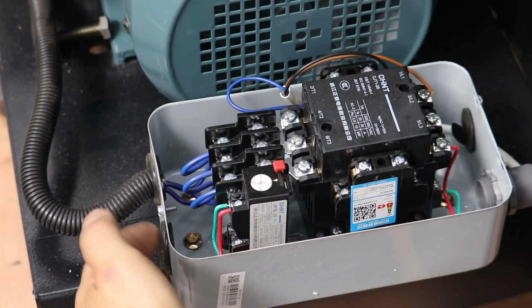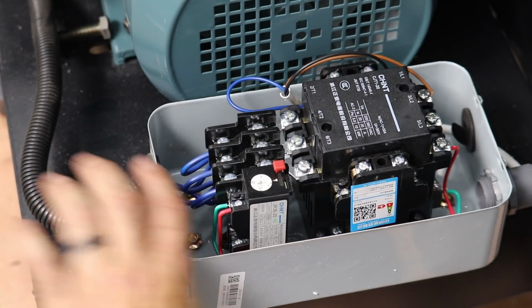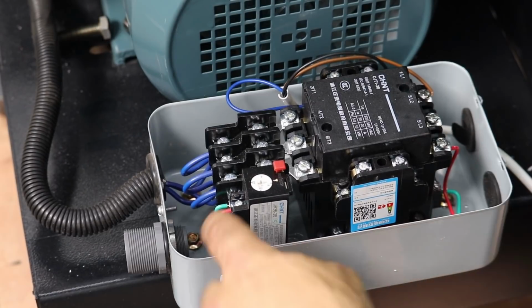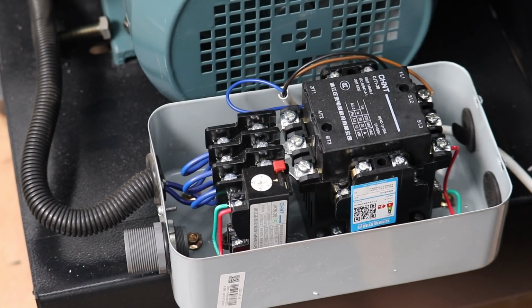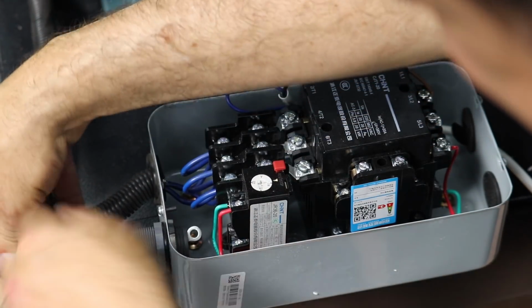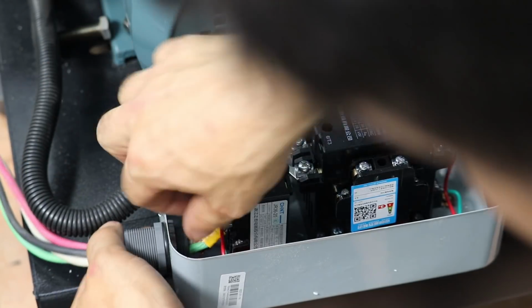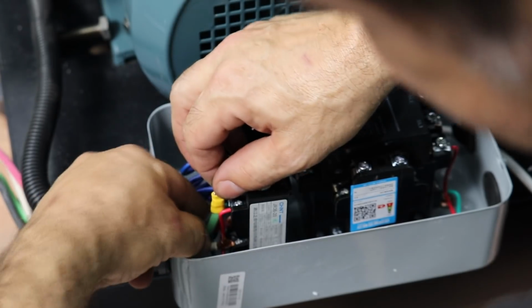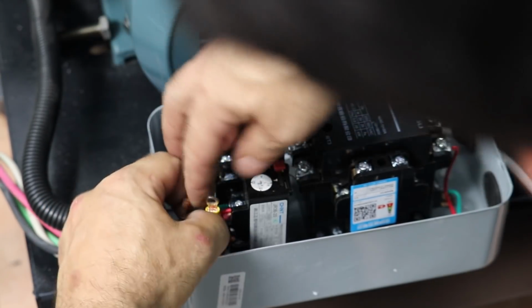But I'm gonna go to the other side of the box back here. That way the cable's not jammed up on this door, which swings open as well. So I'm probably gonna cut into the cable there. This isn't good practice, because our hot wire coming in is going right by our outlet that's switched, that safety switched. But I'd rather do it this way than run the risk of opening up the power cord through rubbing on this side access door.